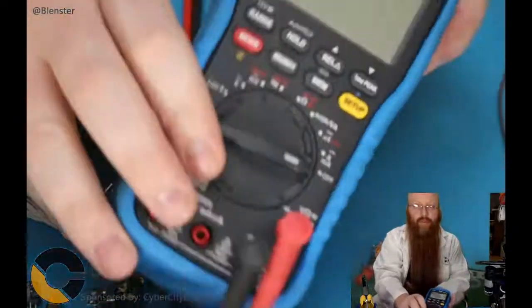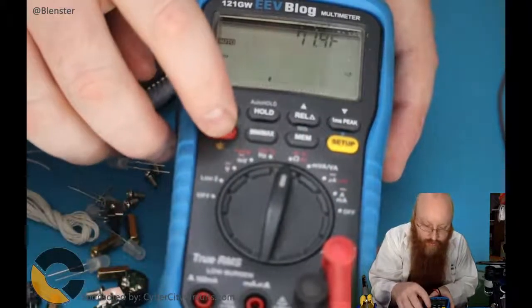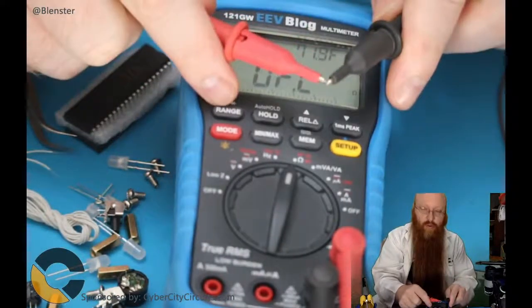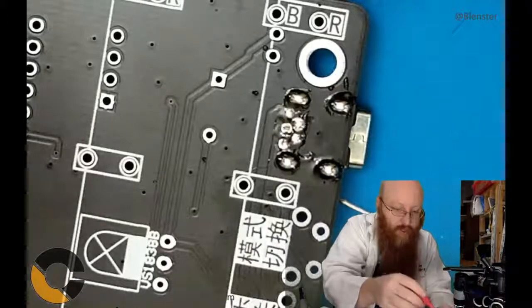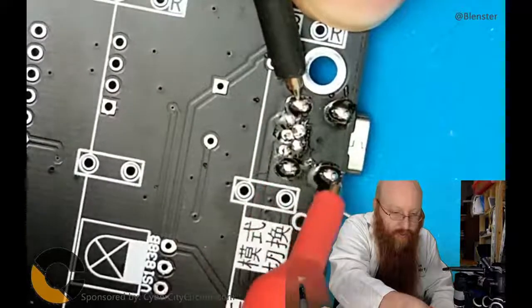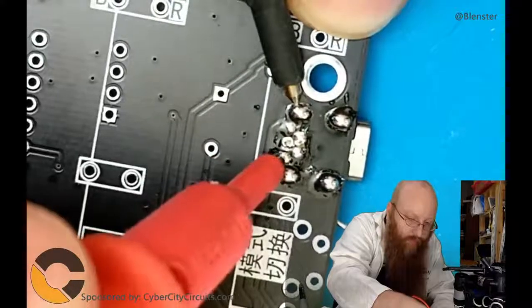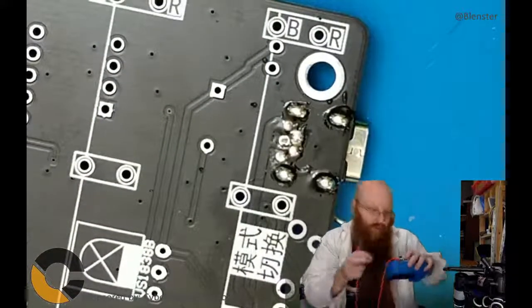to switch to our multimeter. We're going to put it on continuity mode. There we go. Where when we touch the two, we get a reading and we get a tone. So now what we're going to look for is continuity. We should see continuity on the body. We should not see any continuity to any of these pins. Unless that pin is the ground. And it may well be.